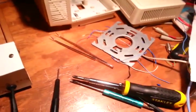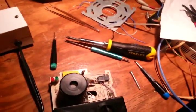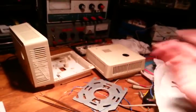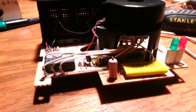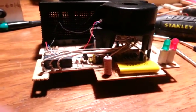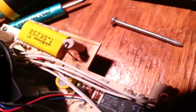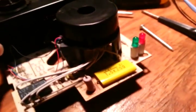I was able to get it with this flat head screwdriver here, but they are screwed in very, very tight. I had a hard time getting this screw out, and the screw in that one I can't even get to budge at all. I have previously tested the detector by hooking up a 9 volt DC power supply across the two terminals there, labeled B minus and B plus. But these machines don't normally run on a 9 volt battery - at least the 710CC. There are other versions I believe that do run on a 9 volt battery.